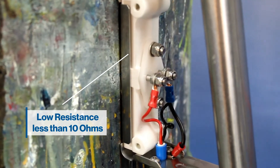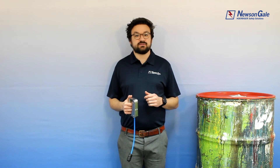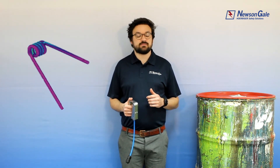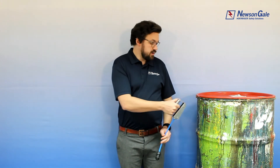The clamp achieves a connection of less than 10 ohms to equipment due to be grounded. Neodymium magnets are the strongest type of permanent magnet available commercially, and the application of the clamp does not rely on the angle of the clamp teeth to make a good low resistance connection. Unlike conventional grounding clamps where the clamp grip is determined by the spring strength, the magnetic force is emitted from neodymium magnets within the clamp when pressed against the ferrous metal surface.